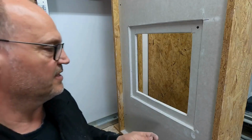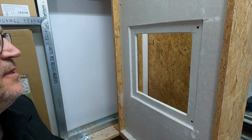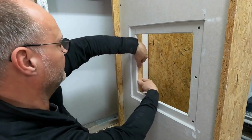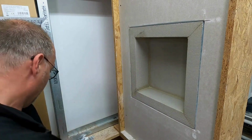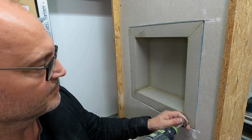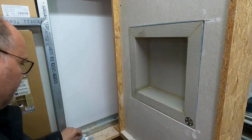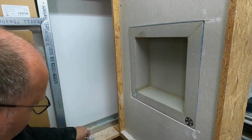This is just a sample wall. How you screw it on site always depends on your materials. This is just for demonstration purposes. We'll also do one on the other side. Now I'm using these plates and can screw them in here. Normally, I would even go into the corner here. This way the plate presses a bit more into the material, and this joint, this shear as well, is also additionally secured a bit. I forgot one thing.